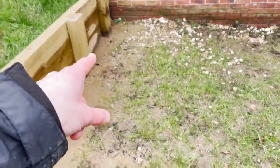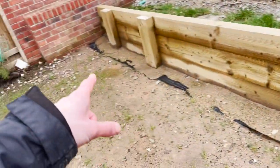I think a big part of the problem is I dug the trench for the wall to sit into, but then I filled the trench with sand. The water is just seeping through the sand to the bit of hardcore and it's all sitting there, soaking into the wall with nowhere to drain off to. So I'm going to dig a trench from this side all the way down to that side.